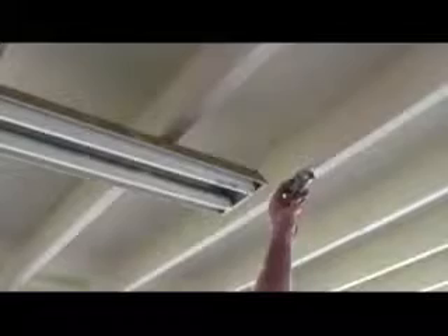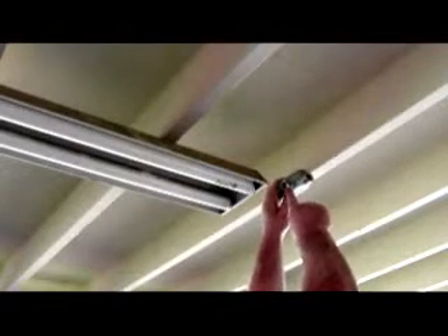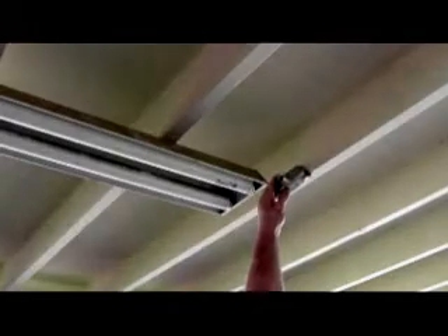From this outlet we're going to come up with a piece of conduit and mount a box here, then come off with a piece of flex that feeds into this light. We're going to continue down with conduit, go over that header, and then mount a box right about in between those two studs there.